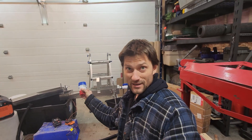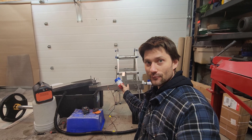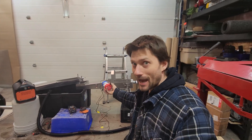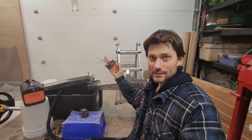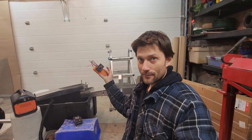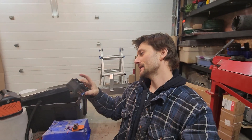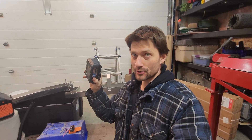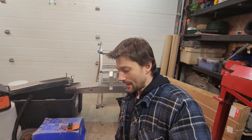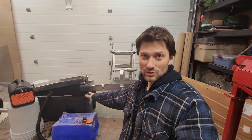Basically this pump burning 42 watts is going to last quite a long time on a battery. I burnt the other one out in the field because I wanted to show it actually finding gold, but I was running directly off 18 volts. A pulse width modulator wouldn't be too hard to set up — you can use your existing batteries and off you go. Based on my math, this is a 6 amp hour battery, which is 108 watt hours, so over two hours runtime on the little pump. And if you wanted to use the big one, it'd be about an hour and a half running at 70%.